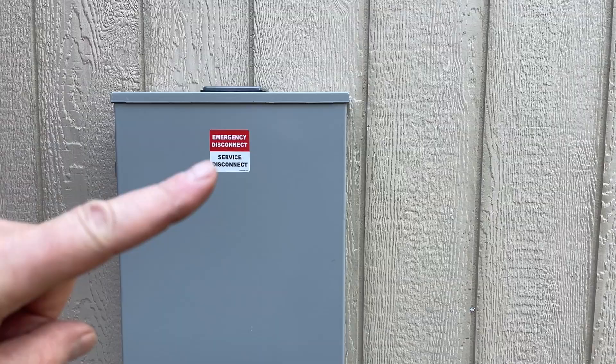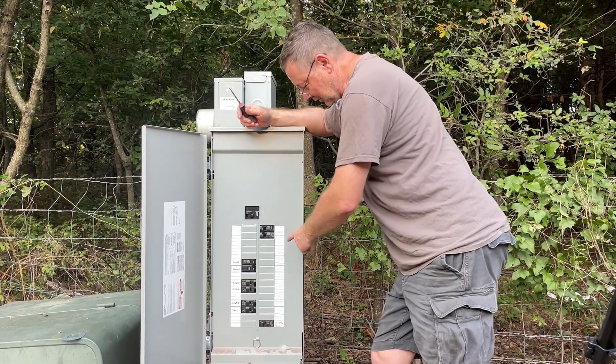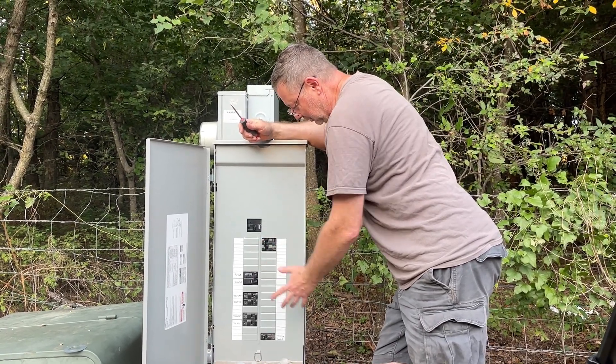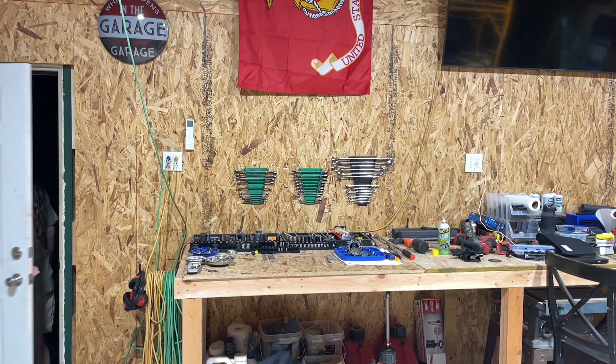Don't forget to put your sticker on so that firefighters and emergency services know where the emergency disconnect is. Also, when putting in your cover, don't forget to notch out your breaker plugs — otherwise when you go to put the cover back on it won't fit. And that's pretty much it, all wrapped up! Thanks for watching — hope you got something out of the video. If there's anything specific on outlet wiring, wire sizing, or grounding, shoot me a comment. Until next time, I'll see you back here in the shop.